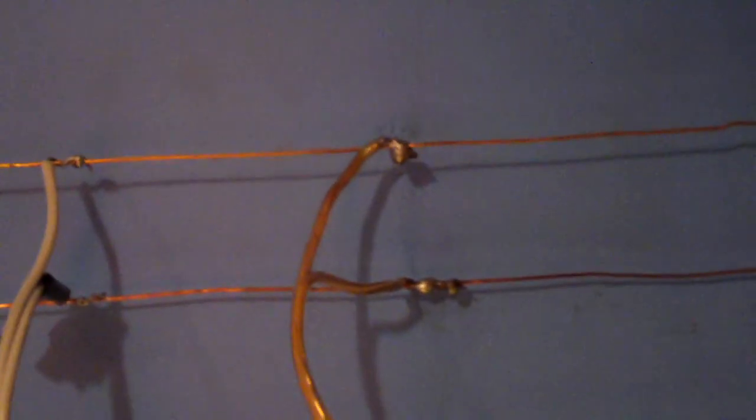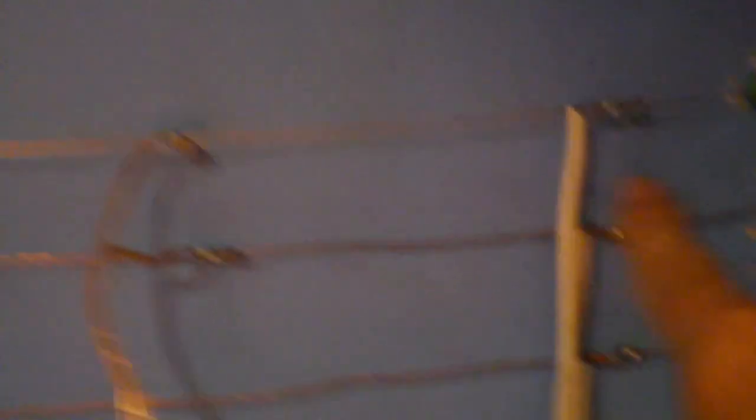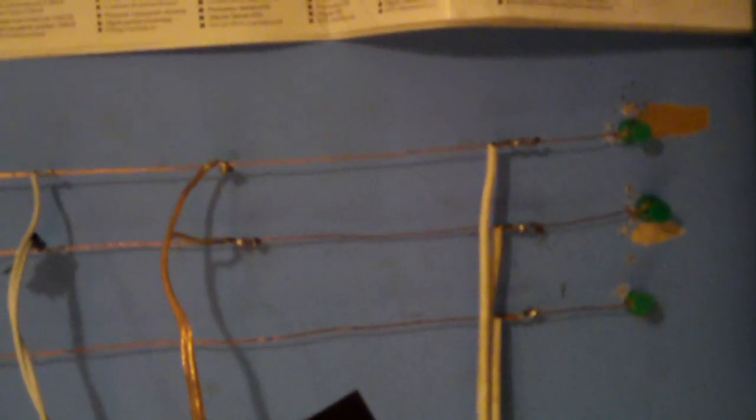What's funny is this copper wiring is a little bit thinner than the aluminum, but copper is such a good conductor and everything solders right up to it no problem. I use 60/40 lead-tin rosin core solder and a little bit of flux just to make sure I get a good connection. Everything is connected very well — no resistance at all; I can touch this and it's not even warm. With a 20-watt halogen, a 35-watt halogen, the fan, and the pencil sharpener running — that's probably about 4 amps of load — the copper wire barely even gets warm and the connections stay cool.